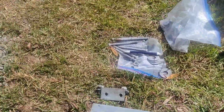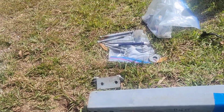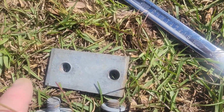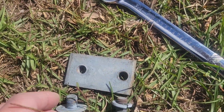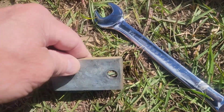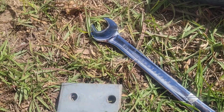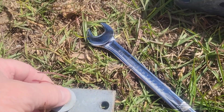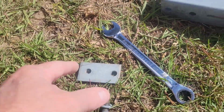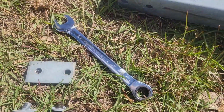Another thing. These are all commercial grade, I would assume, so they all use machine screws. With machine screws, you got an issue. Lots of times, these got to match up exactly when you put them back together. If you don't, you turn that way, it's going to cross thread. You got to have it exactly the same way. And in some cases, if you use this one over here, it'll cross thread it as well. So make sure you got all these lined up correctly, because I had a time trying to get them threaded in because I had my screws all mixed up.